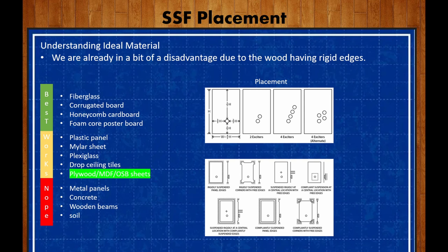In the description I include a link to 'Exciters and Tactile Transducers 101,' which tells you exactly where the best placement is to get the best audio quality. What this guide recommends is that if you're suspending the medium — say a piece of wood floating in the air with the audio puck on it — that is ideal. But we have rigid edges on every side except the top, so you want the puck offset a little bit to get the best audio sound.